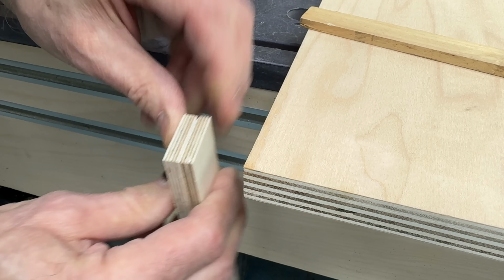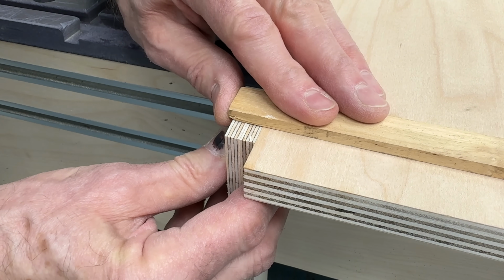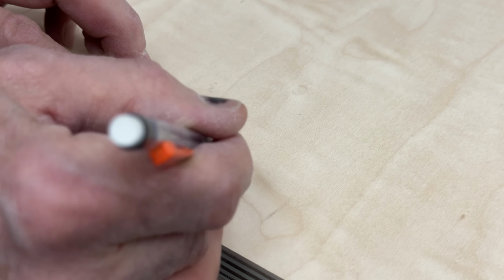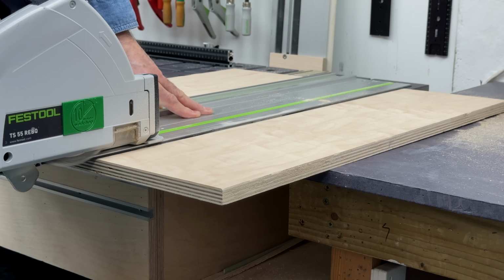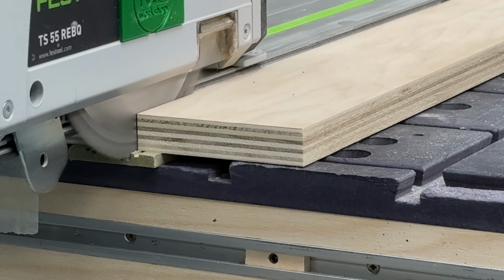The 18mm top, shelf and base need to be the cabinet width less the two 6mm outers, and I'm using offcuts again as a gauge against our rod for this measurement, cutting the two different plywoods down to width. They need to be the same depth front to back as the liners, which happens to be the same width as the guide rail, so no gauges or measurements needed here. I'll take an easy win where I can. So these are easily cut to size.